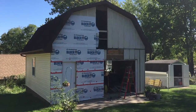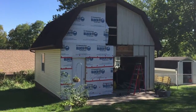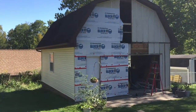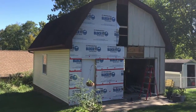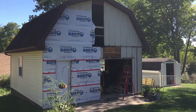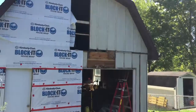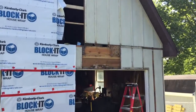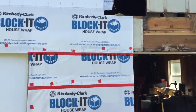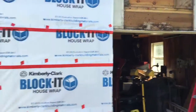My shed, which is where my little workshop is, I'm doing a lot of work on right now. The previous people that built it put vinyl siding on all sides except the front. The front was plywood that they painted, so a couple sections rotted out. I'm in the process of replacing all the rotted sections, then putting up new home wrap, and then I'll be putting in new vinyl siding to match the other stuff.